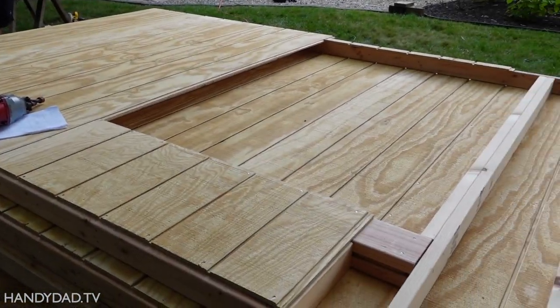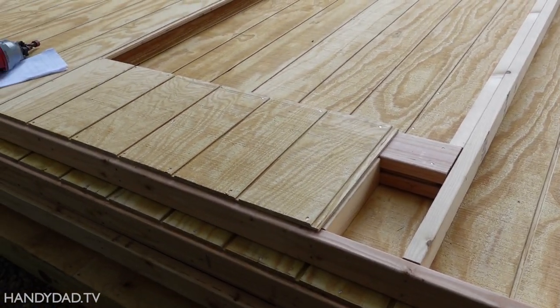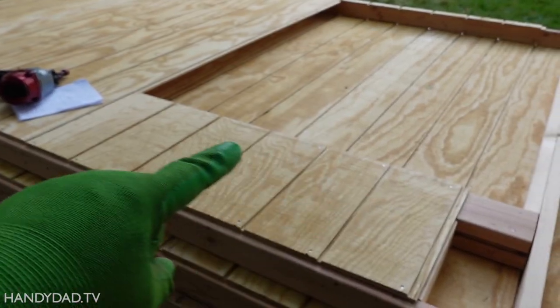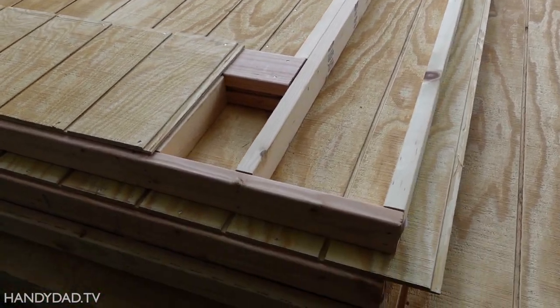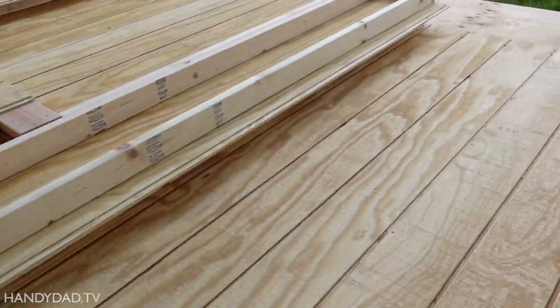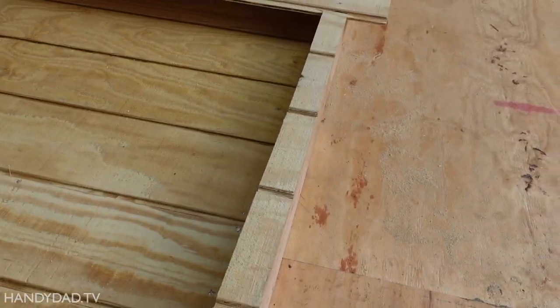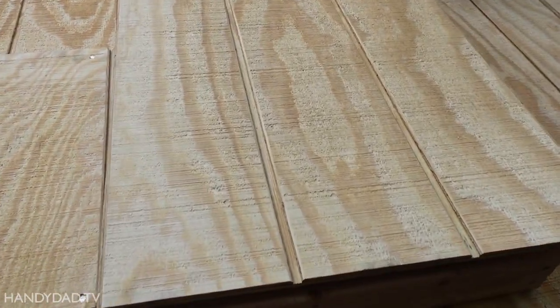This is the side that obviously has the roll-up door, so that's a big 5-foot wide opening. We didn't waste a full piece of siding for that, so we just cut this piece for the top. Now this last piece, in order to get it straight, it's going to be even there. And down here we just put a little piece of scrap just as a spacer.